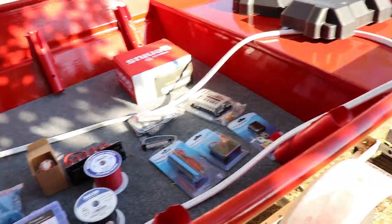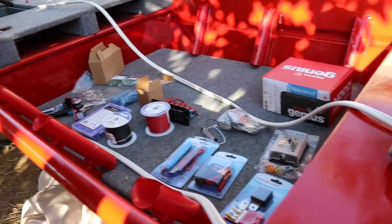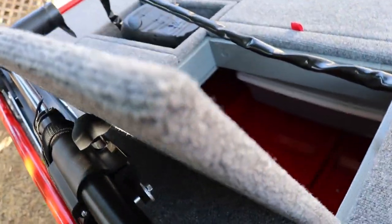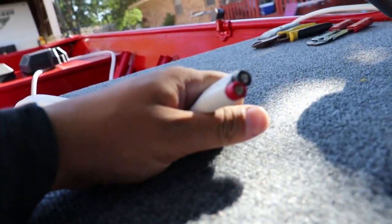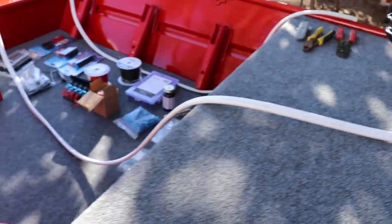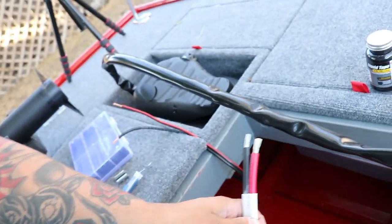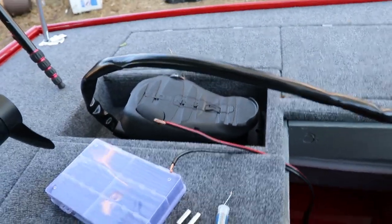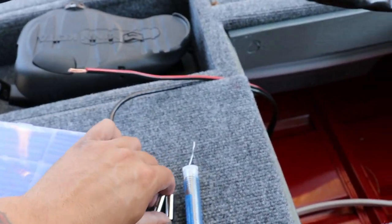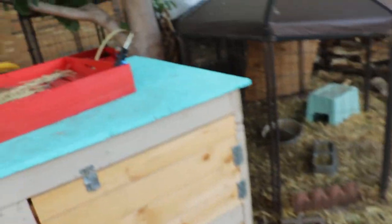So that's a full breakdown of my entire electrical system — this is going to be a project for sure, but I'm down for it. I wasn't going to film this but I was like, I have to film it — I filmed the entire process, I can't just not film the electrical wiring. So today I'm just going to start with the trolling motor. We got 6-gauge marine wire — this stuff is thick but it will last, it is made for being on boats. I just ran this 6-gauge wire through the rib of the boat on the side, it goes all the way through there, under the bench, and comes out up front. It will connect from here to the wires coming from the foot pedal. So I got solder, two uninsulated butt connectors, a whole kit of adhesive-lined heat shrink tubing, and the soldering iron heating up.